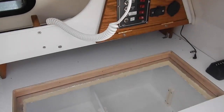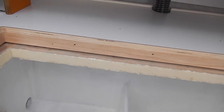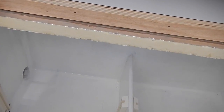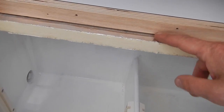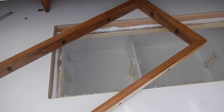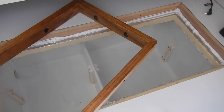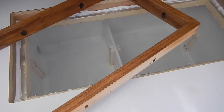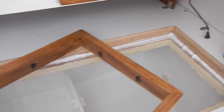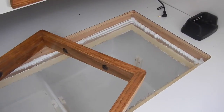Flush with our apparent success with the electrical wiring, we're going to continue on and put the lid for the icebox in. The first thing we're going to do is run a bead of caulk around all four edges to prevent any loss of cold through that little gap. Our outermost trim piece needs to fit into this opening and be screwed in place — we've got elongated holes for mounting this to the surrounding frame so that we can get it hopefully perfectly flush with the surface of the countertop.